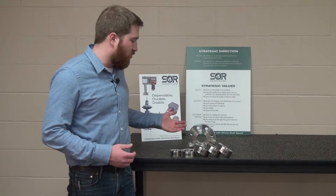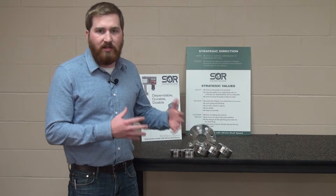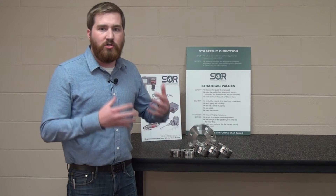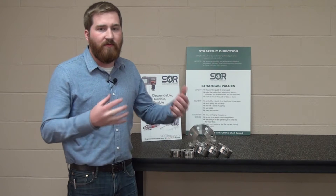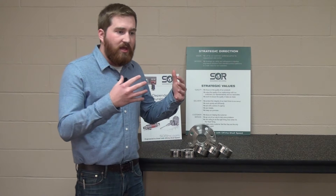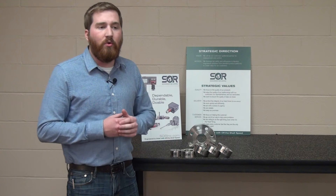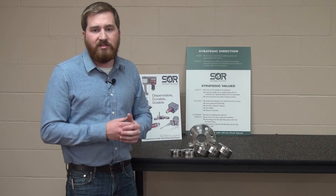Often referred to as a drip ring or a calibration ring, the flushing ring is typically used in between a process connection of a tank or vessel and an instrument connection of a pressure switch, transmitter, or differential pressure transmitter, to prevent clogging of that instrument connection. Typically clogging occurs when there is a process material that contains a sticky substance such as paraffin or even particulates floating in the actual process material itself.